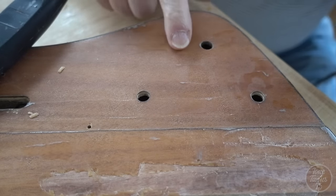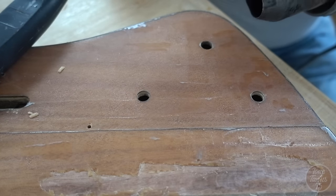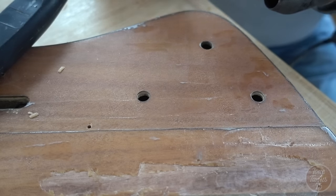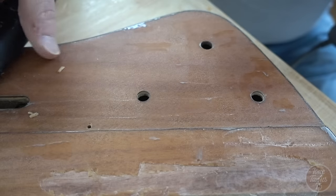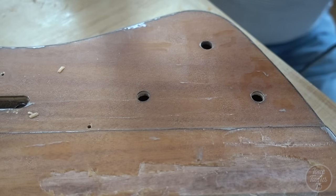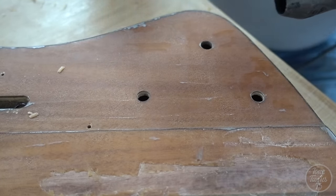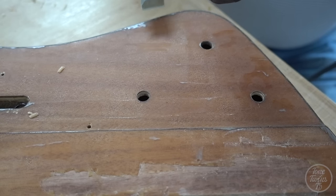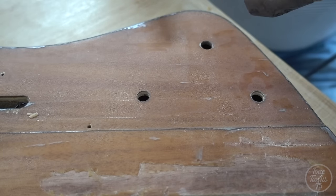What I've got to do now is get this stripped back to bare wood, and that's the difficult bit. Although you can absolutely blast it with heat and it kind of pops off, you're going to risk burning the wood. So what I find works better is to use a really sharp chisel and a medium setting on the heat gun — I don't want to get it too hot at all. I find it best to work across the grain. If you work with the grain you have a greater chance of gouging out the wood, so I'm working across the grain.